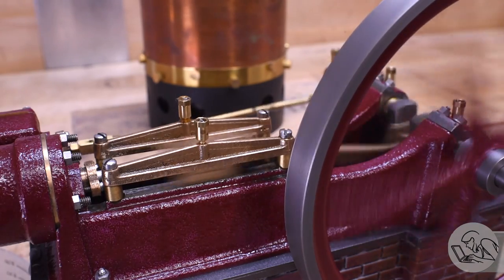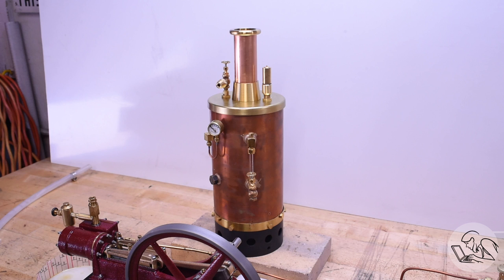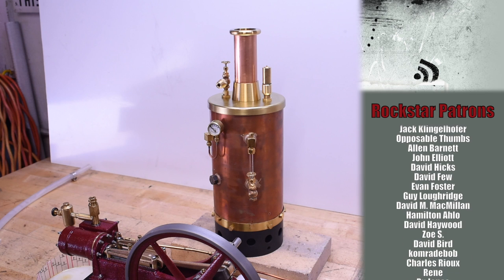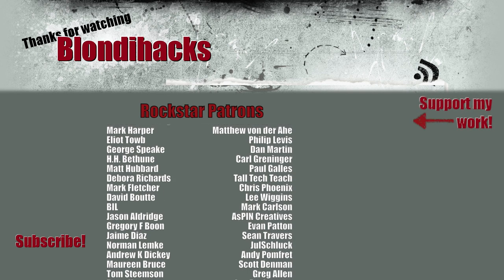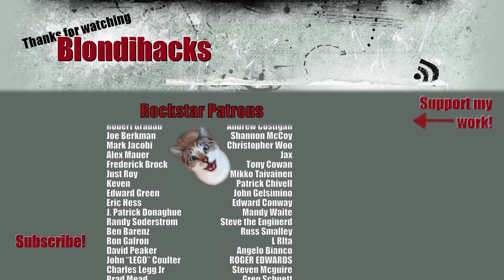Well, the boiler runs an engine, but it's far from done. We still need to put some lagging on there, and I think the burner still needs improvement — efficiency-wise it's struggling to keep up with the engine a little bit, not creating steam quite fast enough. So it needs more heat, and this boiler definitely needs a feedwater pump. It makes steam like crazy, but it goes through the water fast as well, and it doesn't have a lot of capacity like my pot boiler did. Feedwater pump coming soon. This is obviously a huge milestone, and I want to thank all of you who supported me along the way, even through the times when I was cutting it apart on the bandsaw and starting over. Look where we got to now. Thanks for your support, especially to my patrons — you all are keeping this thing going. I will see you next time.